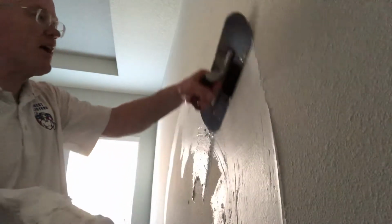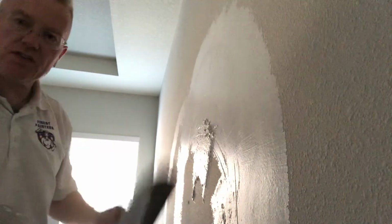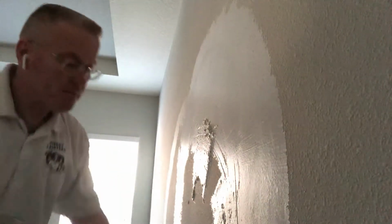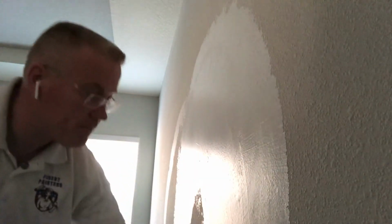Now I got the blade at a 45-degree angle, and I'm making a rainbow-like motion. You see it in the camera, right? Now, I'm closing in on that rainbow. I'm filling in the center of it, the inner part of the rainbow, so to speak, okay? Why am I doing this? It's just the easiest way to apply the compound. Because you can only go up so far, right?